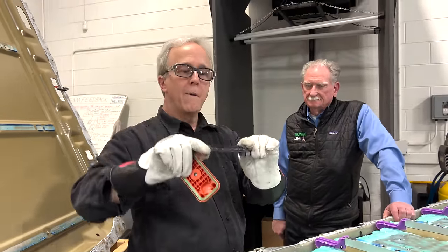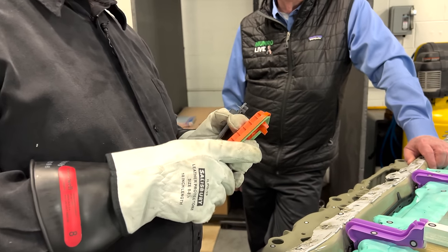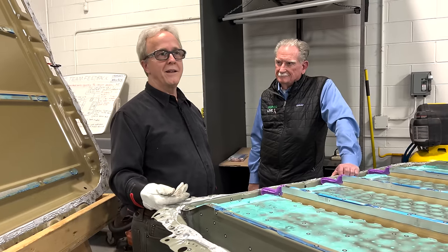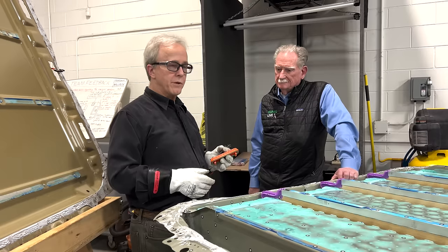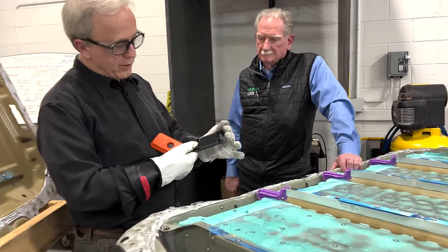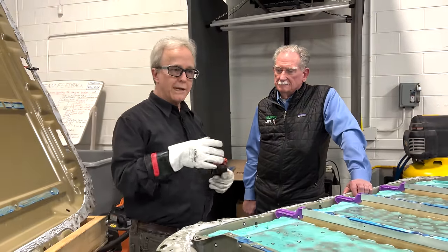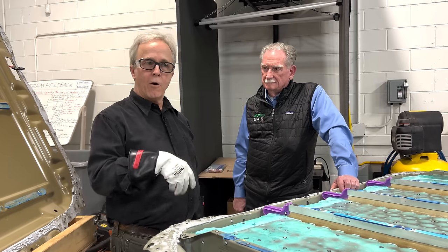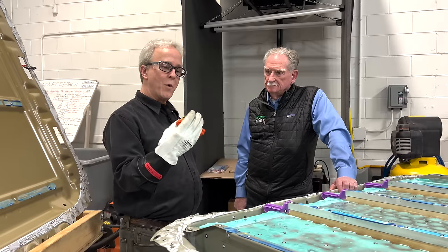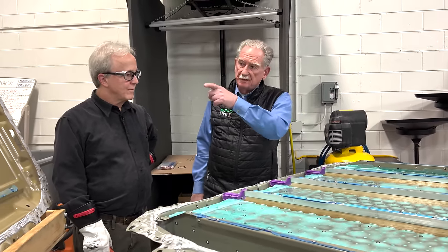What's left is this fancy little device - without a better name, I'll call it a spark arrester. When a battery goes into thermal runaway, one of the conditions people are most worried about is a projectile that comes with the flames. In certain battery chemistries there are particles that come out that can blind people and start fires in adjacent areas. This spark arrester would capture those particles and gives you a tremendous amount of ventilation capacity once the cap's removed. It's like an innovative mushroom valve - a check valve device - but this is a rather one-way valve, only one way once.